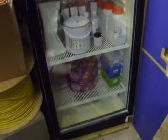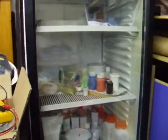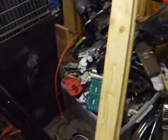But I had been using the oil-filled radiator down there, which is 700 watts. It's excessive for a sealed insulated cabinet just to keep it warm, and the temperature would vary. So it's got a big old thermostat on it. It just lagged behind so much.